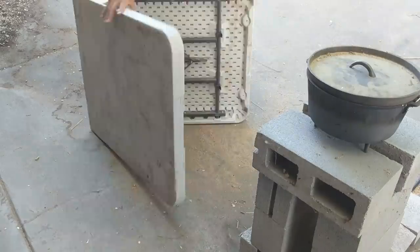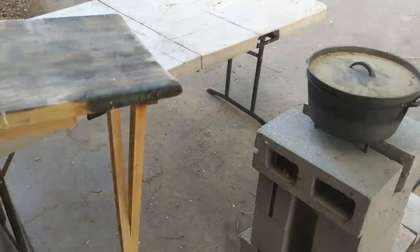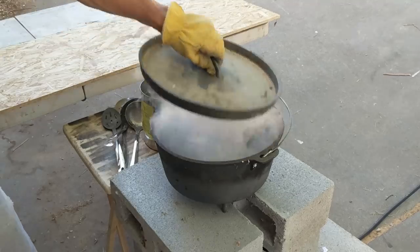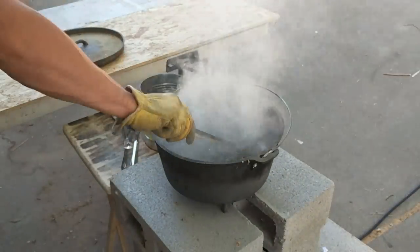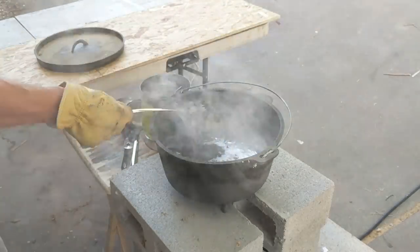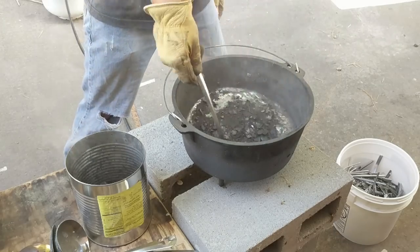The Dutch oven lid helps retain heat and melt the lead faster. To hold the ingot molds and ingots I'm using my trusty plastic folding table with a wood board on top to prevent the table from melting. As you can tell by all the smoke, I missed some of those black x-ray papers — burnt paper is really stinky stuff. I scoop out the garbage and dross on top with some cheap dollar store kitchen utensils and throw it into a number 10 can.